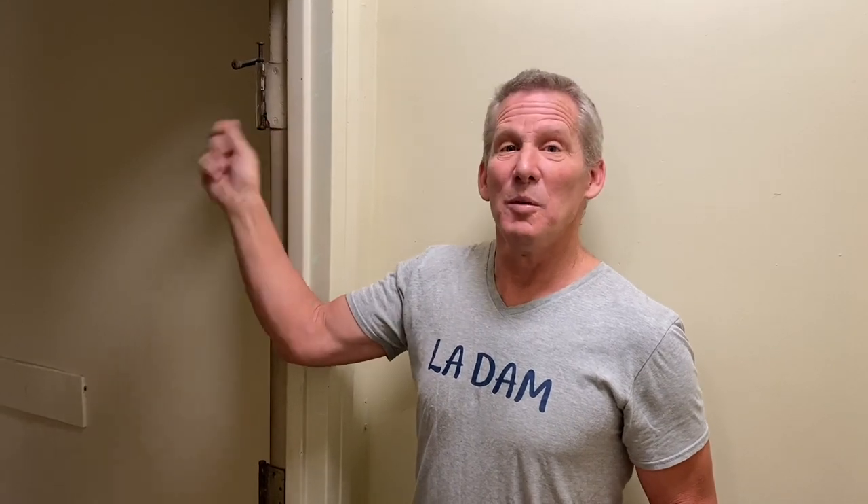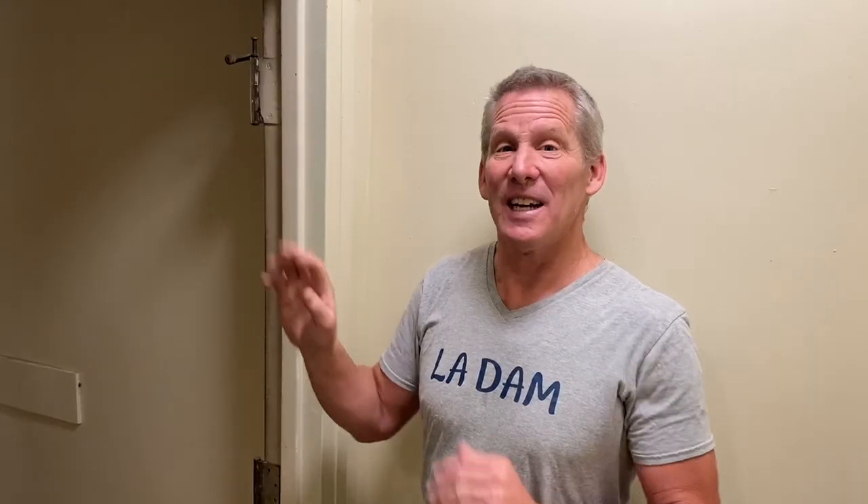The second scenario would include what we are going to do today. We need to replace the door, but we could not find a door that had the exact same hinge locations as our existing jamb. So what we're going to do is remove the hinges, install the continuous hinge, install the door — and once you know how to do this, you'll be able to make a lot of good money doing it on your own.